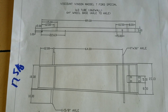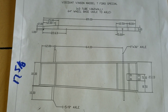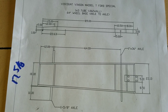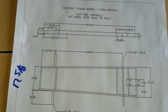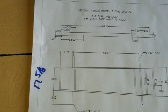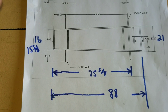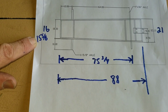Here are the original plans for my cycle cart frames. After I built my frame I took some pretty careful measurements and this is the result. The 17 and 5/8 measurement at the front is the actual front measurement minus the little mounts for the spring shackles. This is version 2.0 — initially I marked down 16 inches, that's 2 inches minus 18, but it's actually 15 and 5/8 at the very front.